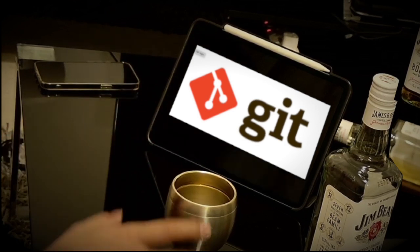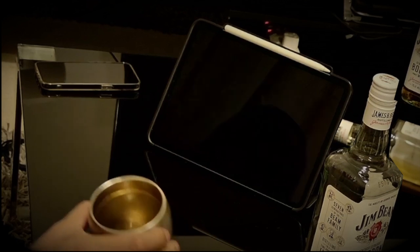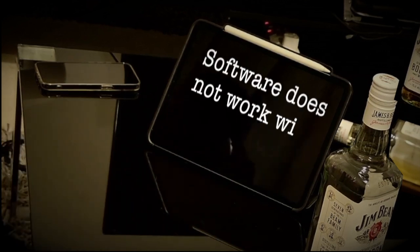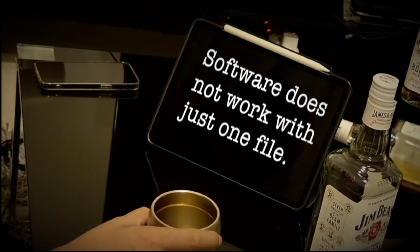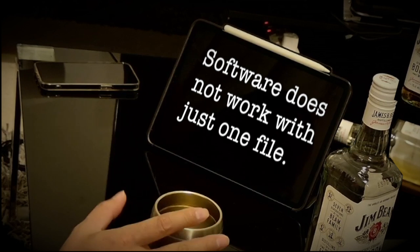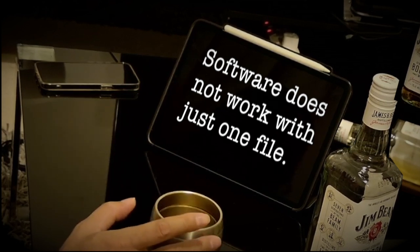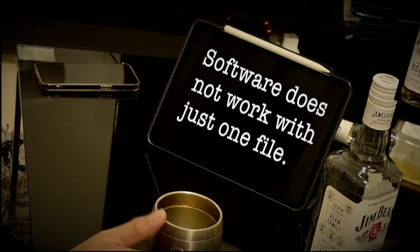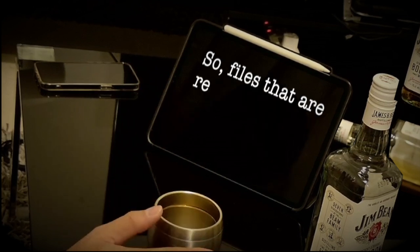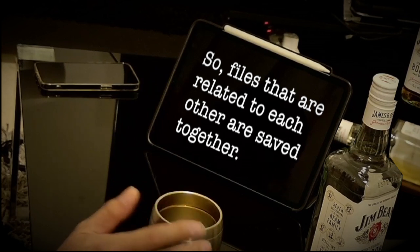I will give the minimum necessary explanation that is easiest to understand in my own way. All software, including LinuxCNC, does not run with only programs listed in a single folder. It is the programs in multiple files, each working together. For example, I mentioned a while ago that you need to understand INI and HAL files when you start LinuxCNC, and they are closely related. Often when you try to make some changes, you have to change both files to get it to work. So after you save each program, you have to put them together and save them further.